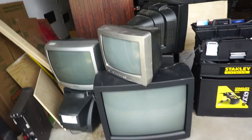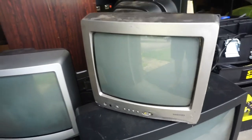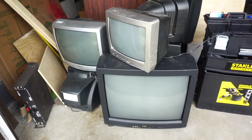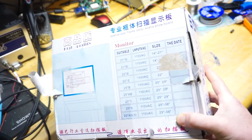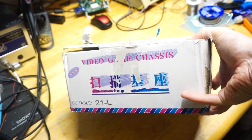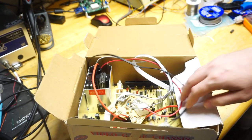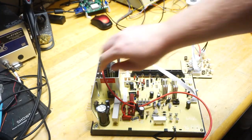I bought a $5 13-inch Sanyo or Toshiba TV from Kijiji, which is a Canadian eBay-owned classified site, freed the tube and mounted it using the original frame. The tube had a thin neck, also known as a CR31, so I ordered a so-called 7-pin universal chassis. Months later, it arrived. This is an HL21, commonly known online as a 14/21-inch universal chassis.